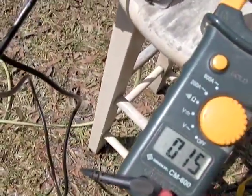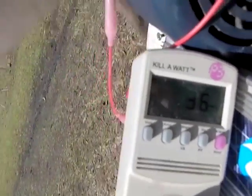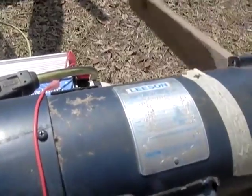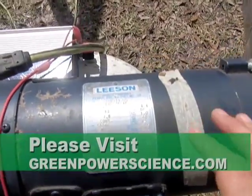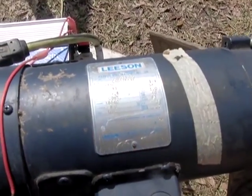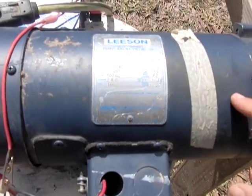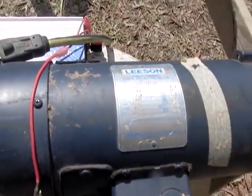It's going. Now we are at 15 volts. So if you're looking for an alternative to a generator for your wind turbine, higher quality DC permanent magnet motors around one-half horsepower to one horsepower are a pretty good option. I wouldn't buy any of these new because this motor is like four or five hundred bucks new, but you can snag these on eBay sometimes for 70 bucks.